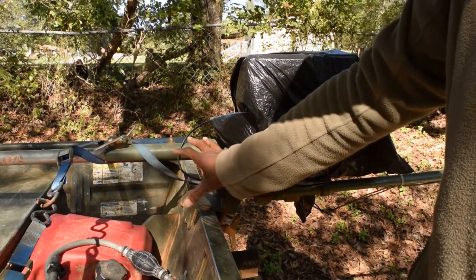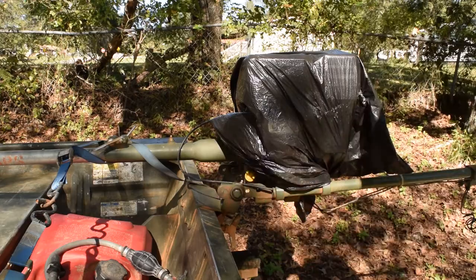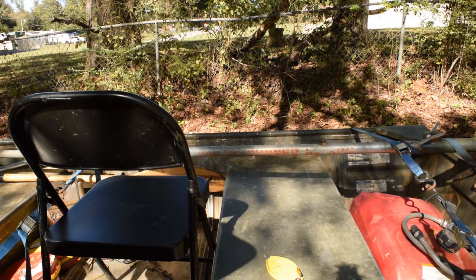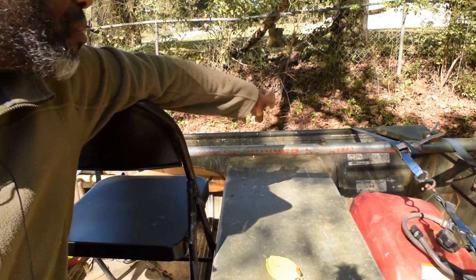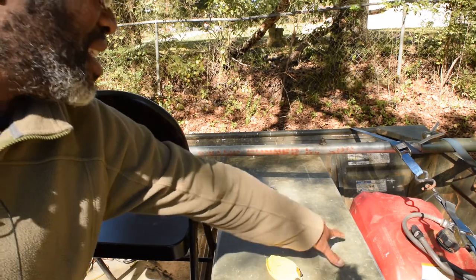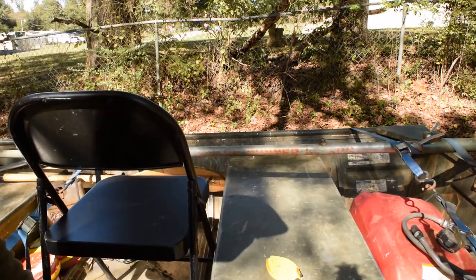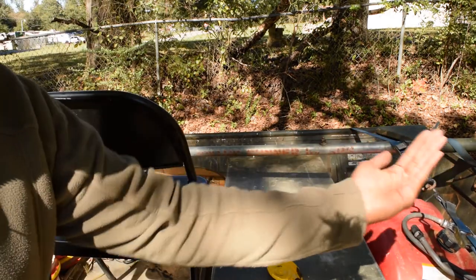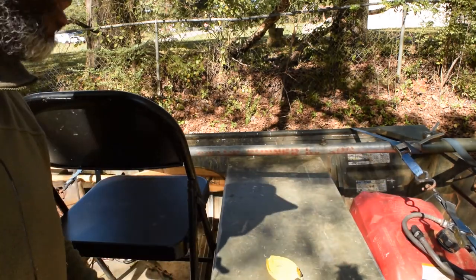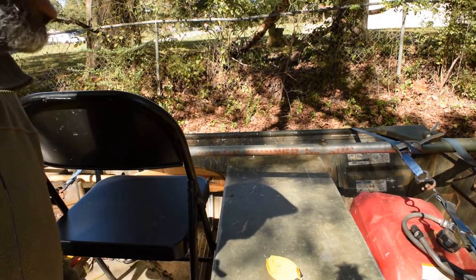This whole motor sits here. It's really too far back. It sets the ballast of the boat off. Okay, so I'm sitting here in this chair. The handle only comes to about here, so I'm reaching back, and this big bench is just in the way. If I sit in the bench, that puts way too much weight back in the boat. If this transom were tilted forward as much as it's tilted back, it would solve all that, especially if you move this bench out of the way.